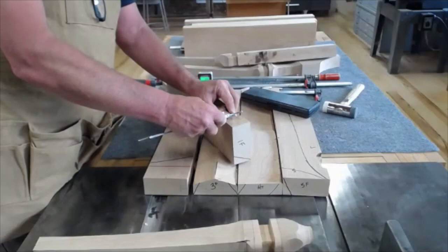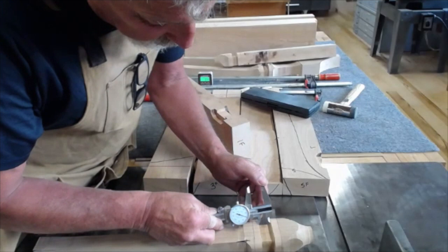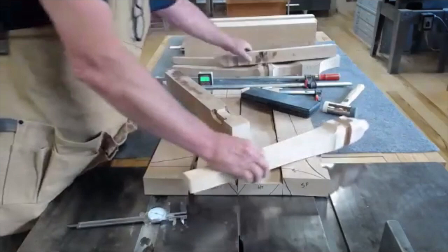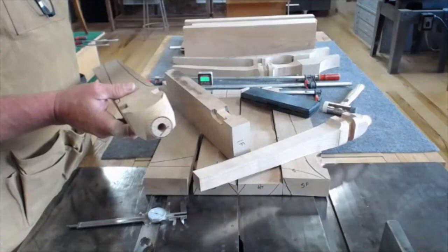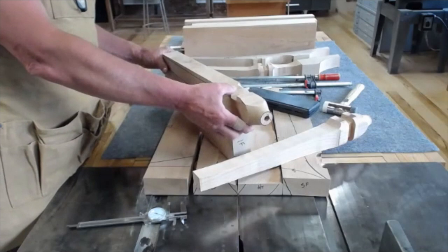And so I think this is 18 inches from here to that dado mark. I will put this 18 inches here and I mark that, prick it. And then I scribe around it. And then when it's square, this one's already been sculpted. When it's square like this, I run it over to the Hammond saw and I cut this dado, all of that on the sliding table. Now, you can do this on a sled, on a table saw.